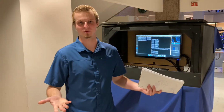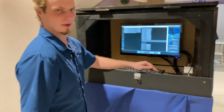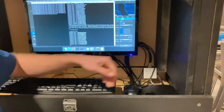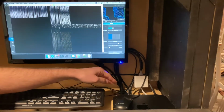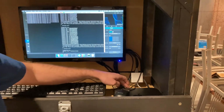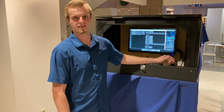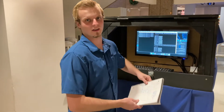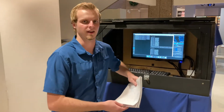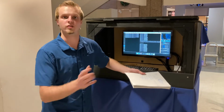My responsibility was the software component of the project. So you see we've got some components right here. We've got the Mac Mini, which runs the show. We've got this connected to our display using an HDMI cable. We've got the operator console, and then we receive a serial input from the Arduino over the serial port. What I've written is a Python script that accepts that serial communication from the motion sensor. So when presence of motion is detected, we trigger the next video.